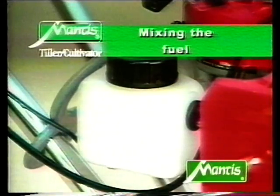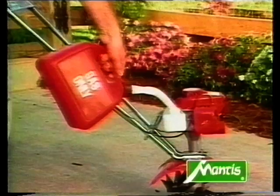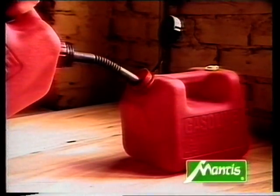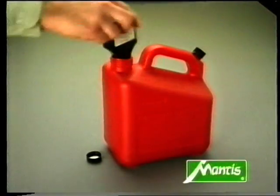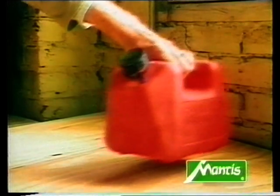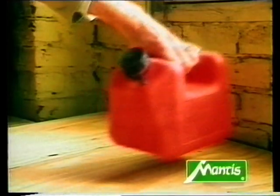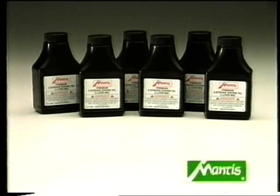You're ready to fuel the engine. Your Mantis cultivator is driven by a two-stroke motor with air cooling. It requires a fuel mixture of petrol and two-stroke engine oil. Never use just petrol on its own in your cultivator. Here's how to mix the oil and petrol: pour five litres of petrol into a safe container, add one bottle of Mantis two-stroke engine oil and mix. Always use a mixture of 50 parts lead-free regular-grade petrol and one part two-stroke engine oil. If you don't, your engine will suffer rapid, permanent damage and you will void the engine warranty. When you need more engine oil, you can order it directly from your Mantis dealer.